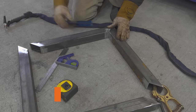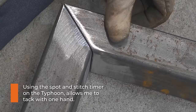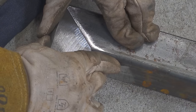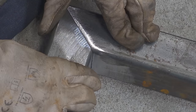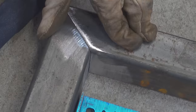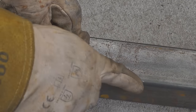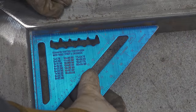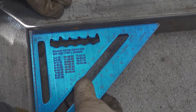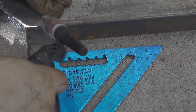We're going to line everything up using just a couple of squares and a tape measure and our welding machine. I like to watch these little lines on the side of the tubes and make sure those are in line as well. I purposely allow for a little bit of gap right here at the top. So while keeping pressure on the corner, I'll put my square in and I actually want to see about almost a sixteenth of an inch of it not being square — that way when I put my first tack in on the side, it will pull inside.